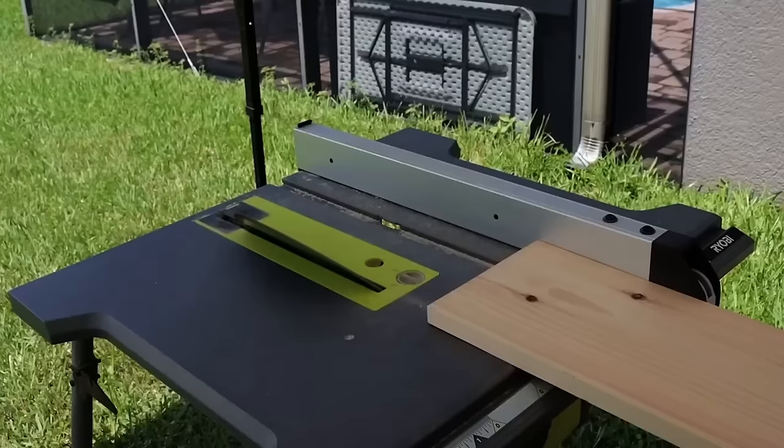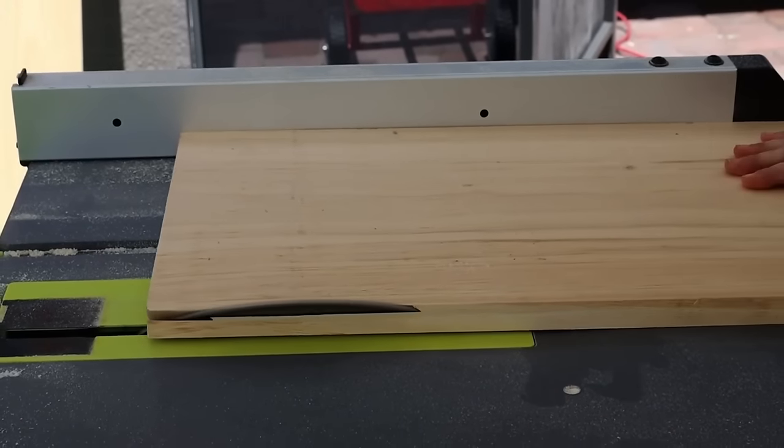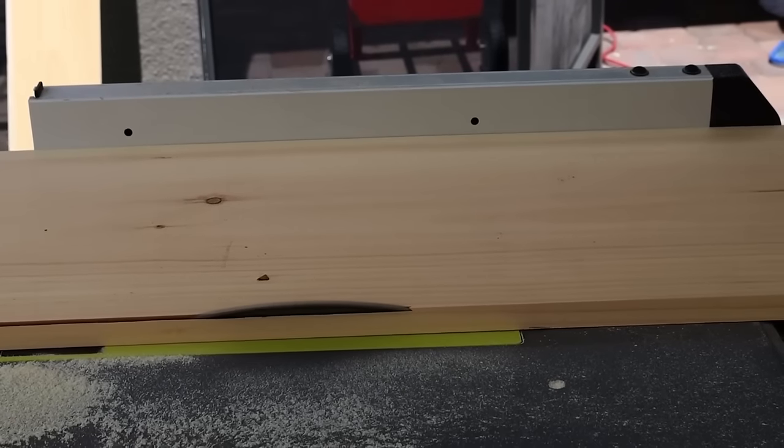The total height we were going for is 72 inches, that's why I went with six-foot side pieces. I cut off the excess on top to use for another part of the clock. Then I took my table saw and mitered the edges. If this part makes you nervous, you could do a total butt joint and join them with nails, but I really do think mitering the edge gave a nicer, cleaner look in the end.